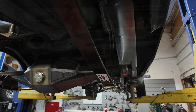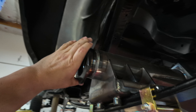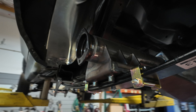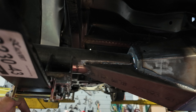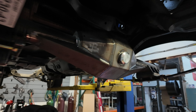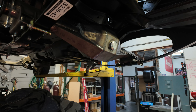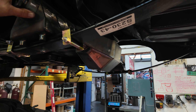So some bonus footage for those of you who watched this far. It's a little dark, but here's that other Nova housing. You can see what I was talking about — the back brace ends right there and there's the through-bolt spring perch, which is super nice. It means you don't have to deal with notching, and if you were hell-bent on using U-bolts this would help too. There's not a lot of unsupported tube. Also you can see that big giant fill cap option if you wanted it.